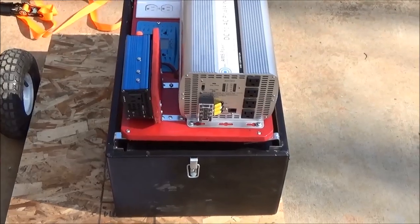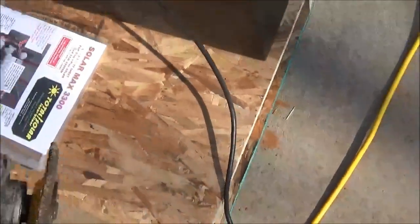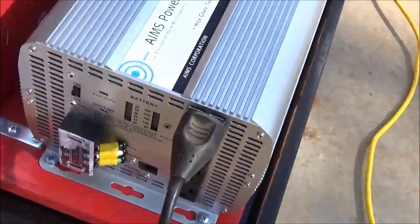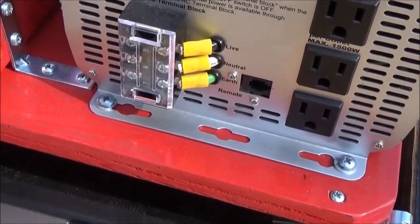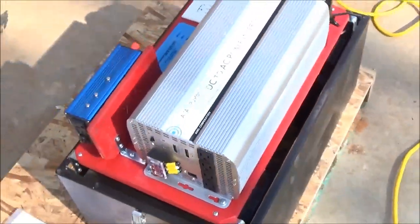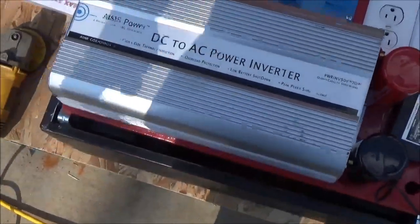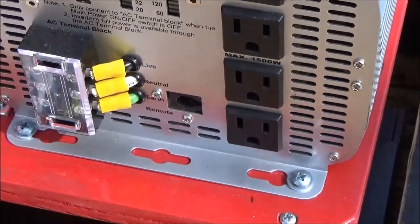Right out of the box she's ready to go. I just plugged in a grinder that uses about 800 watts — no problem starting it on any one of the receptacles. You also have a terminal block where you can wire to a cord or breaker — have a licensed electrician do that — to take the full 4000 to 5000 watts out of that inverter. Keep in mind it's a 24-volt inverter, so you're only going to get 1500 watts per receptacle, but that's usually good enough for most things you'd run off this system with two batteries.